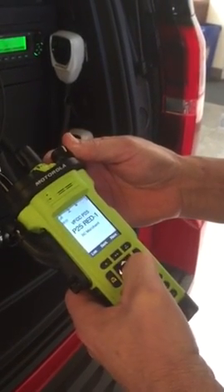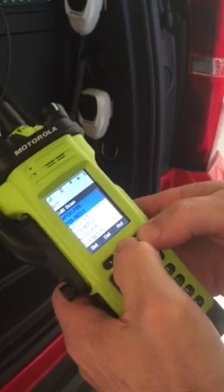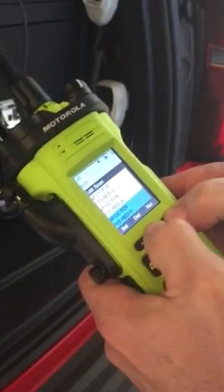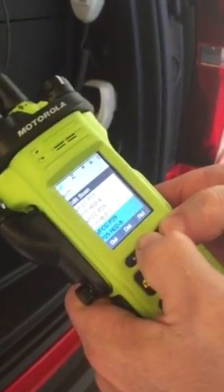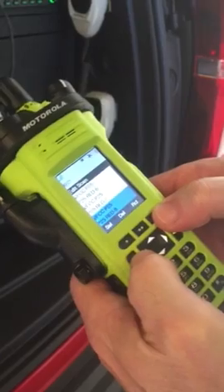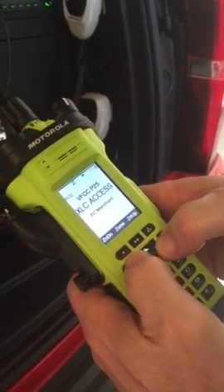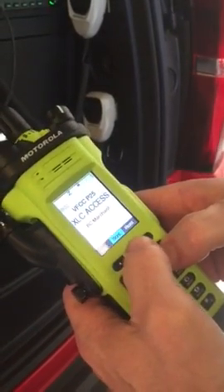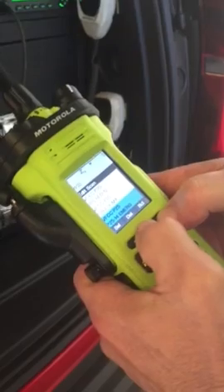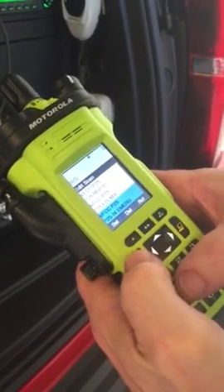Move to your scan list. It's best to begin by clearing all channels in your scan list after a program. That indicates that the scan list is empty. Home out of that and go to a conventional channel. Back into the scan list and clear that as well, indicating that we have cleared all the channels in the conventional scan list.